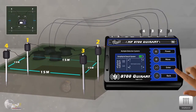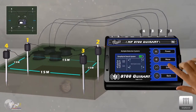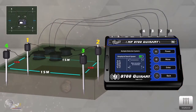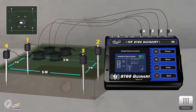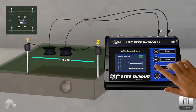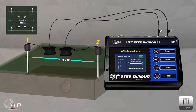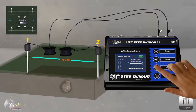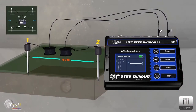After the device completes the scan stage and identifies the target, a message will appear asking for identification of the two probes between which the target was found — there may be more than one type of target. Reduce the distance between probes toward those selected probes to a nearest distance of within 5 meters. After confining the target location, an automatic message will appear asking if you want to specify the target depth. Press Enter and the device will determine the depth using probes number 1 and 2, with a distance from the target's location starting at 45 meters. Gradually reduce the distance to 3 meters, and the device displays the depth automatically and accurately.